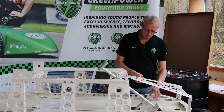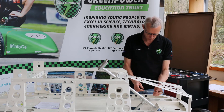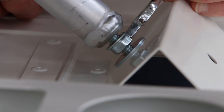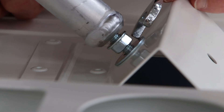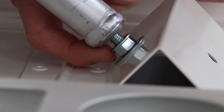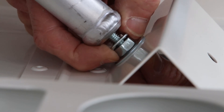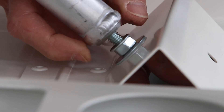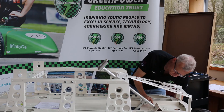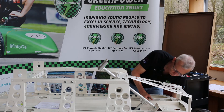If you do plan on using lubricant, please don't use soap — it's not very good on the metal. Back to the build. What we're going to do now is adjust the bottom fixing for the steering column at chassis level. For that I'm going to need a 13mm spanner. You'll see the locking nut — the small plain nut we put on — is quite far from the chassis at the moment. First we need to wind that down by hand so it's touching the bottom washer, making sure the bolt is pushed up from underneath. It's like tightening the nut to the bolt, but we still want to be able to turn the bolt — so it's now touching but not tight.